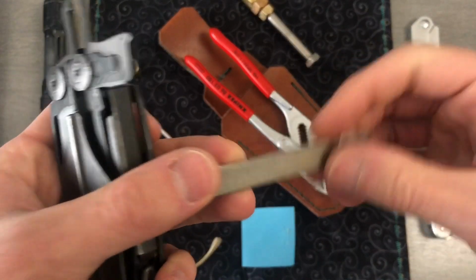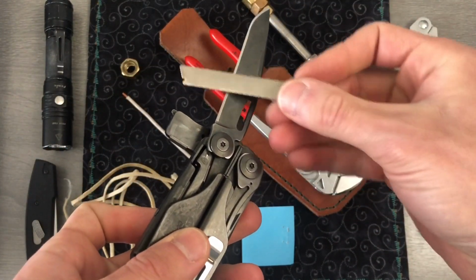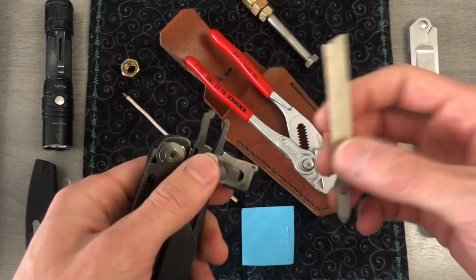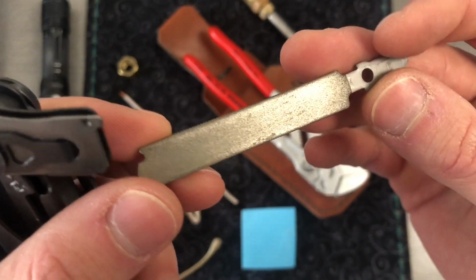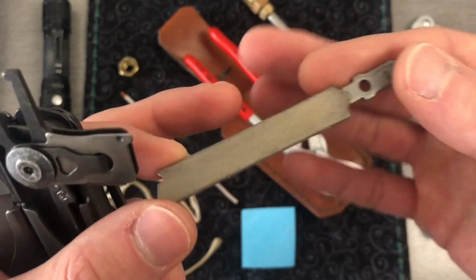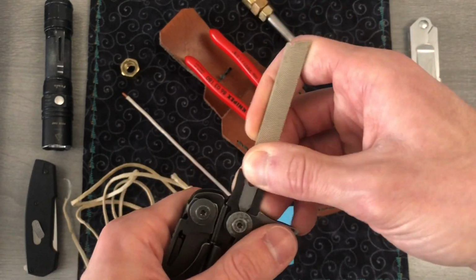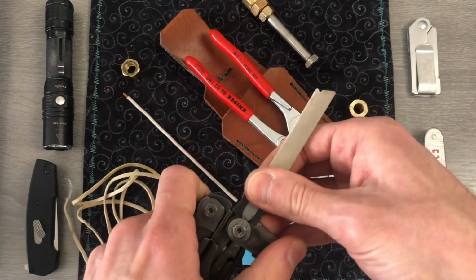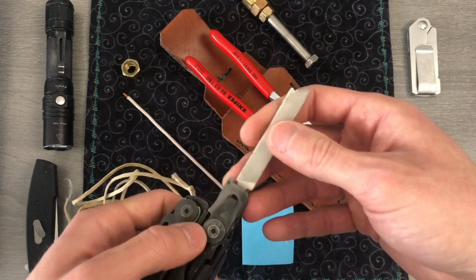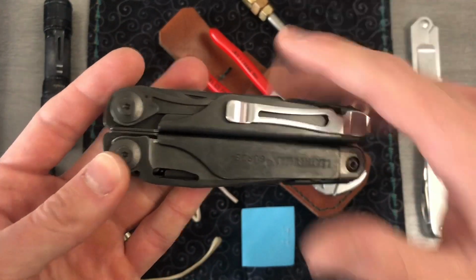So because I can take this diamond file off, I can literally sharpen my tools on the go. This is like a self-sustaining multi-tool for that reason, and I love that. Plus, the diamond side means I can work on filing basically any metal I come across in the lab, which has proven extremely useful already. I was able to modify different fittings and clamps and actually improve some of our machinery just by knocking off a burr here and there and making fitment that much better. So the file is a super underrated but incredibly useful tool.